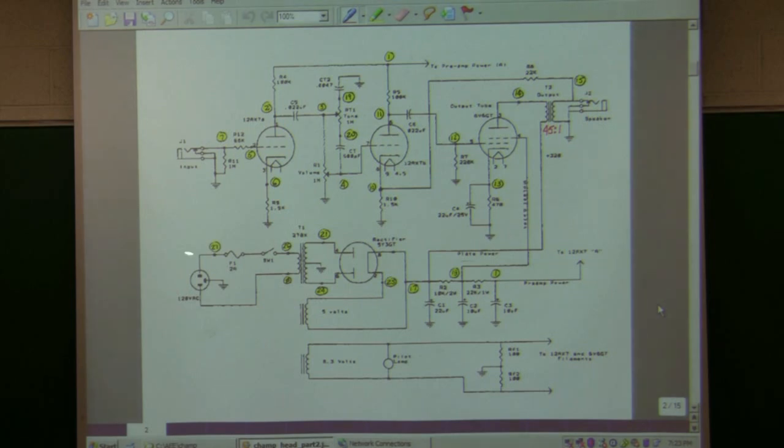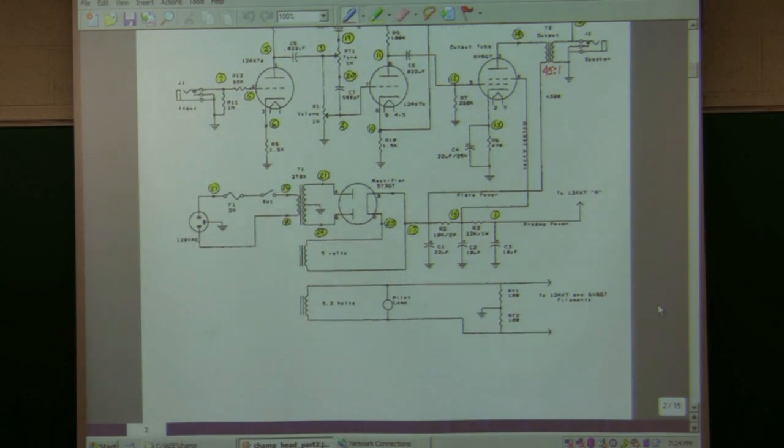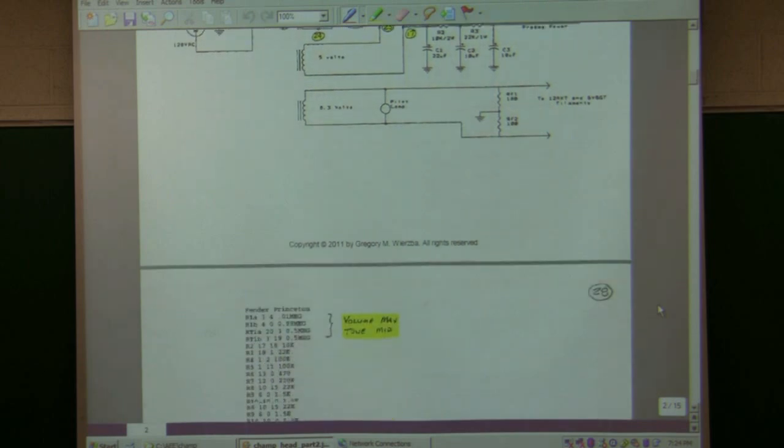And so the input here is actually at node 7, and the output's at node 15, and the input to the op amp is node 4. And when you set the volume all the way to the top here, node 3 and 4 are shorted, and it actually shorts out this R and C. So you get certain sound effects depending on where you put the volume control. And I'll play some music through it. You can maybe better hear the bass and treble in that. A little harder with the guitar to pick out every piece that was there, at least for me.